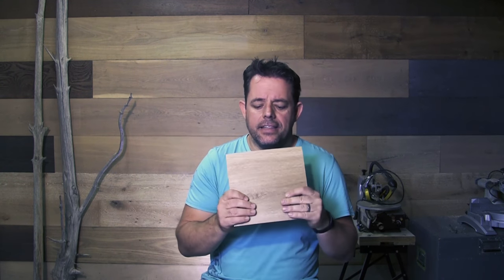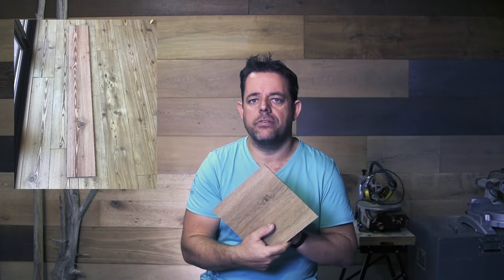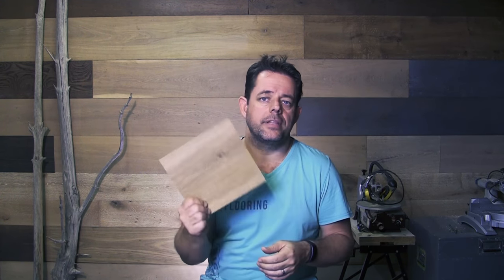When purchasing one of these products, consider how resistant it's going to be in your conditions. Laminates have proven very resistant to sun - high UV resistance and color retention, high scratch resistance - they've really proven themselves, which is why they became so popular. Vinyls, built slightly differently, do bleach out and change color with direct sunlight. They can turn green or fade out, so direct sunlight for a couple of hours every day is going to be a problem. You'll need to consider UV protection on windows, a pergola, screening, or closing blinds during the main sunny periods of the day.